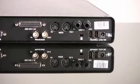Something to be aware of is that the Firewire ports will pass power coming from a computer or other device, but the ULN-8 will not provide power to other devices, and the ULN-8 cannot be bus powered. Finally, there's a 2.1mm coaxial power input. The difference between this and the 4-pin XLR is that the 2.1mm input is not affected by the front panel power switch. Now let's look at the front panel.